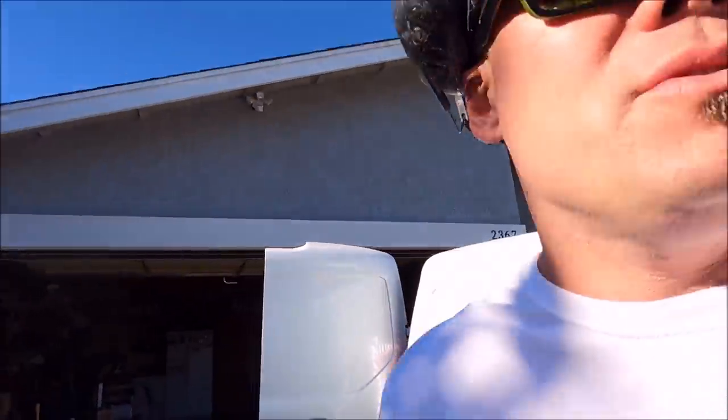Okay, demo is complete. We ripped the shower out. One little issue we've come across, we need to cut the existing bathroom floor tile so that the tub fits. We pulled out a 30 inch. We're going to install a 32 inch, so easy to do. Grinder, shop vac, and a very steady hand. So let's show you the tub.